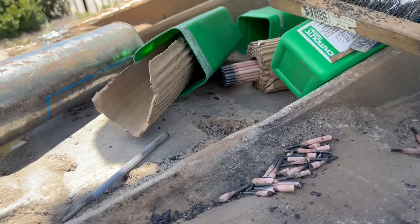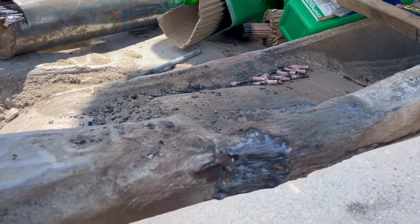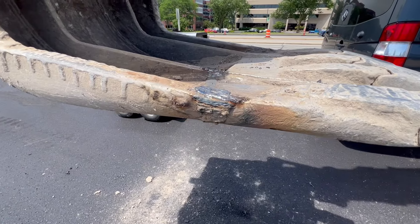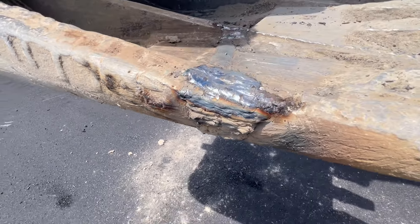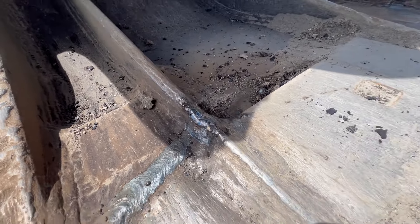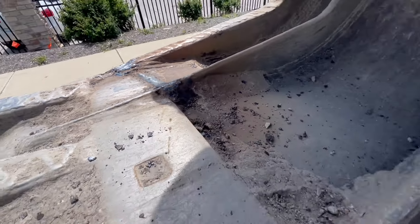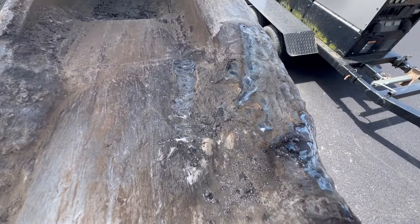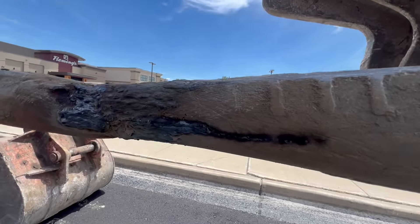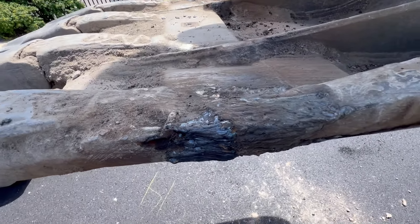This is good enough for now. This should give the customer, depending on use, several months — maybe a couple of years. Long term, he has another bucket and he needs to start rebuilding those. Here's the overview of the finished product, or at least finished for today. All the cracks were gouged out deep, all the weld was replaced with some high-strength rod — good ductility, good strength. My suspicion is this bucket is made out of AR400 or T1 steel, so Rockmount Polaris AAA was the right choice. I had to stop at some point — I can keep welding till the cows come home, but this is where it's at. Thank you for watching, I'll see you on the next one.